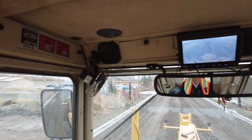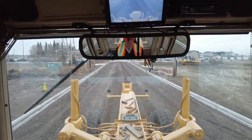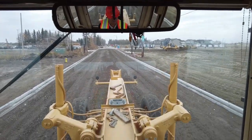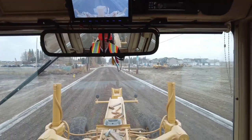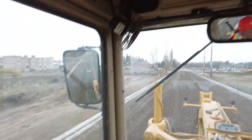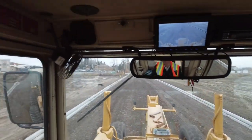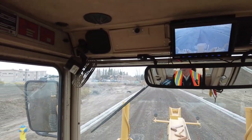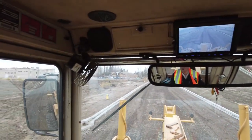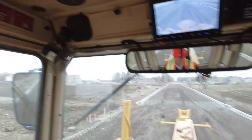As I'm doing this, I'm steering with my articulation mostly, because you gotta stay in the right spot on the road. Okay, backblading fairly heavy. You see how the windrow is way over there? I just crossed over a high point. Backblading it fairly heavy. And I'm steering as I go. I'm mostly watching in my mirrors to line up.